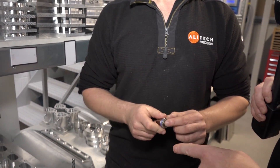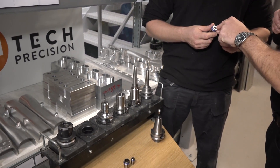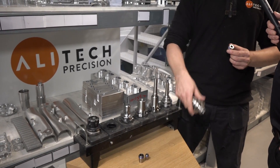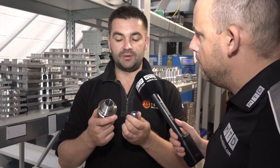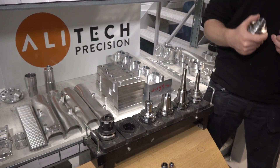What's good about the Centro P? Is it the collet or is it the combination of the tool holder and the collet? It's a combination. We did it primarily because of the RPM, but it's a combination of the two for accuracy. The holders are rated at around 1 micron runout and the collets too. Comparing that to what we were using - a 20 micron collet and holders probably around 5 micron - it's quite a marked difference.